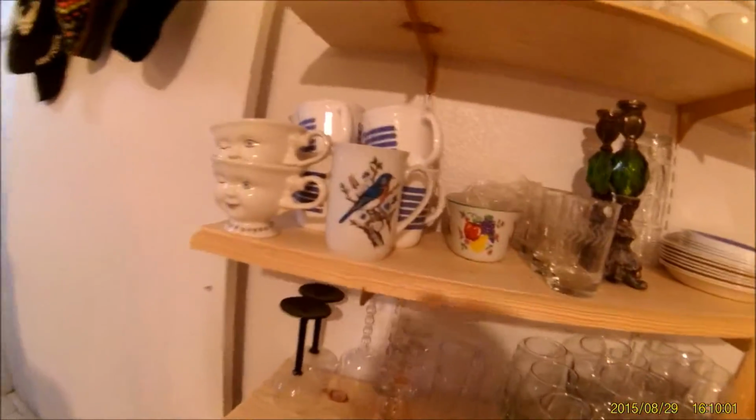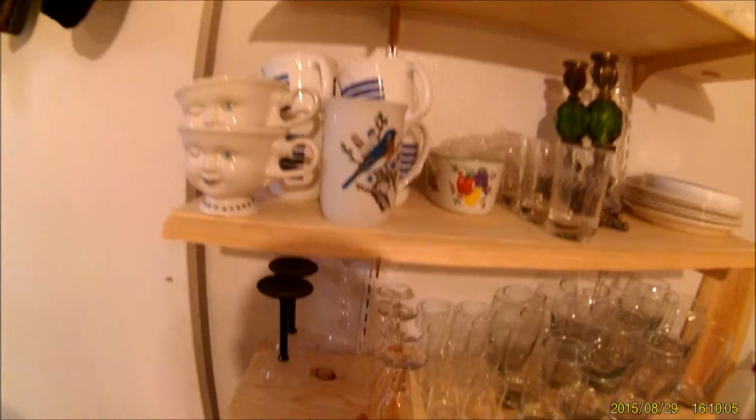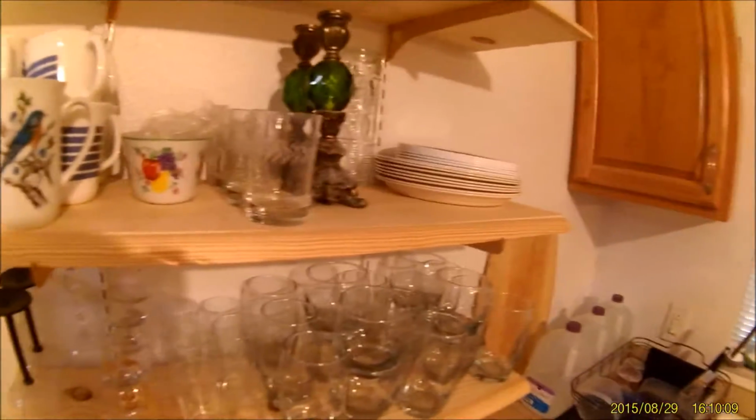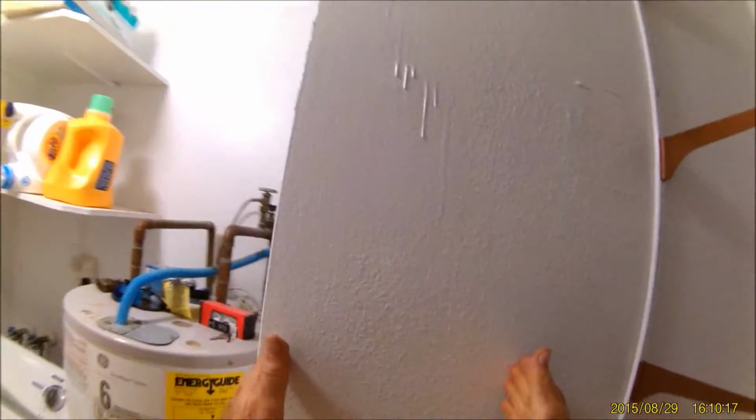And that one's pretty close, but really, it depends on where you put it. I don't want to move that around because I got all these dishes up here. But basically, think about what that rack is going to be supporting. It's going to be supporting this half, so let's put it in the middle of that half. This one's going to support this half, the middle of that half. And this one is supporting 1/3 of the middle, 1/3 of the left side, 1/3 of the right side.